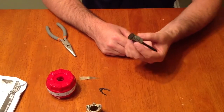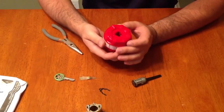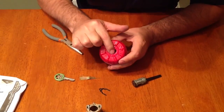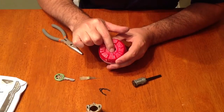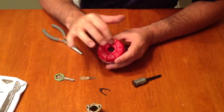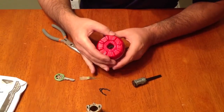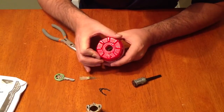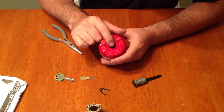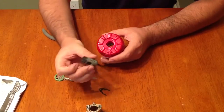We're going to put the cover cylinder casing aside and just focus on this plug. To rekey it, it's very simple. I'll try to orient this for you — down in the middle circle you see an image of a lock with a little hole near the keyway. On the exterior ring you see an arrow. The first step is to get that arrow facing toward the image of the cylinder.